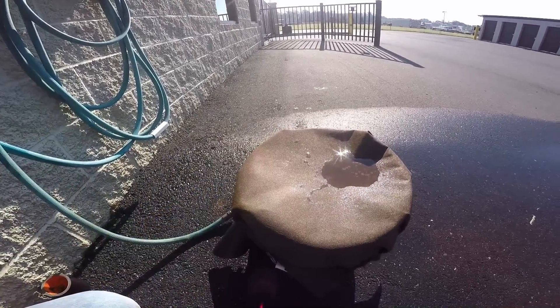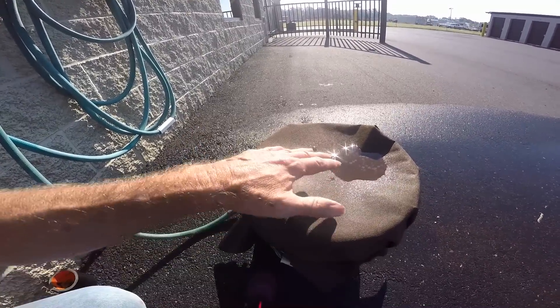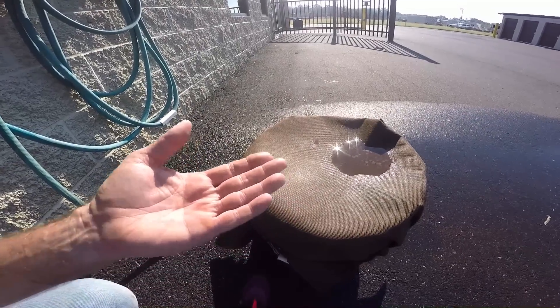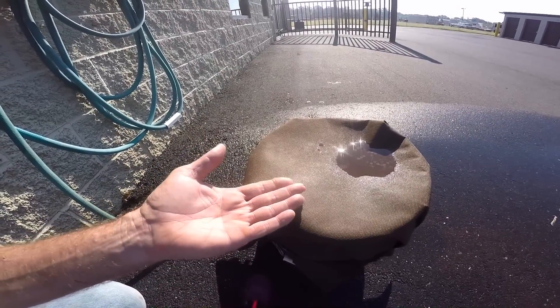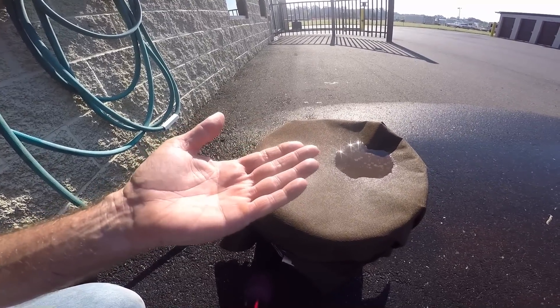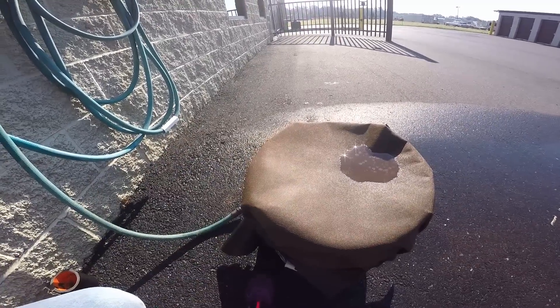True, it does get down into the gravel eventually, but remember how the system works: gravity is pulling it down. There's gravel at the bottom, water floods up into your trench along the footer, and is carried away. How fast this stuff works — well, this demo shows it. I'm not a big believer in fabric, and I'll show you another reason why.